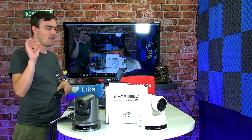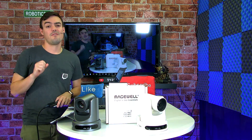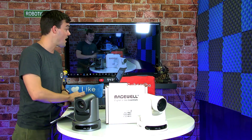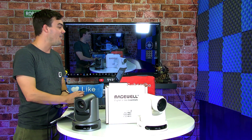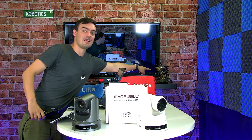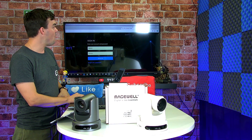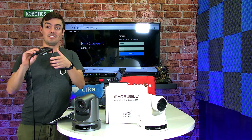The PTZ section does come up. I'm still working on getting that working, but for those of you who are not using PTZ cameras, this is a really great product. For those of you that are, I guarantee we're going to figure it out — it has to do with a cable pinout issue. What I just did was click the little cog in the bottom, and that's going to open up a web browser that connects directly to this device.